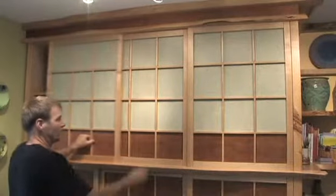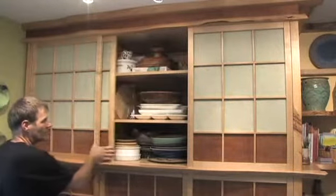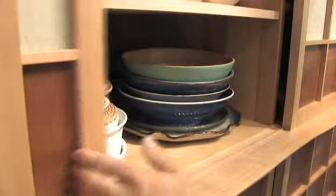Another option is to forgo hinges and build doors that slide on tracks in the case. Just make sure to leave enough depth at the front of the case for the tracks that guide the doors, which usually means setting back shelves, partitions, and the like.